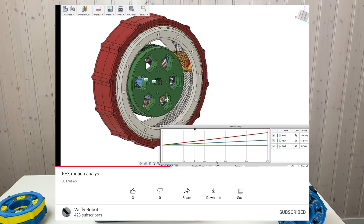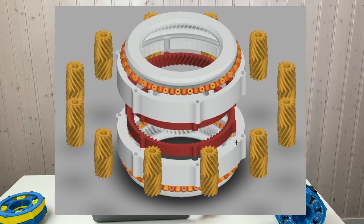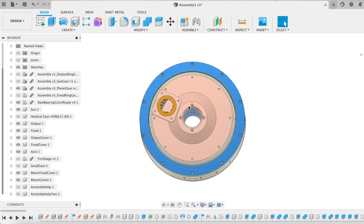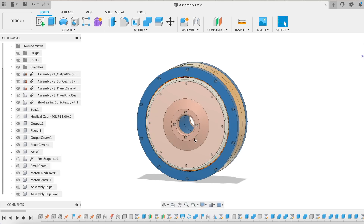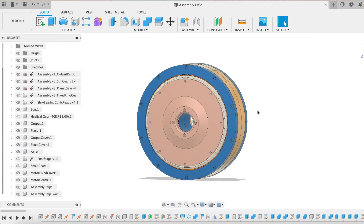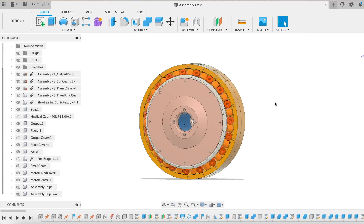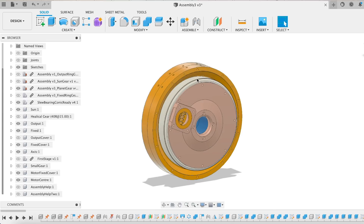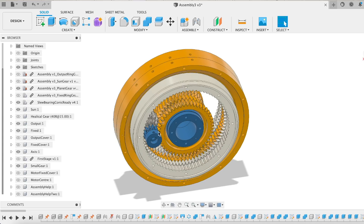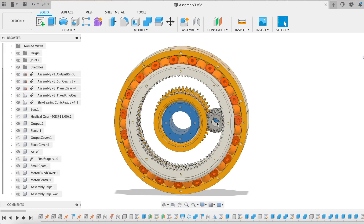This channel also experimented with this gearbox and came up with a quite nice design. My design is very similar to this one, but made for the stepper motor. Here the stepper motor should be installed, this is the fixed ring, and the output ring is over here. These are our slew bearings — one from this side and another from this side. And this is the sun gear, which is going to be moved by the stepper motor.